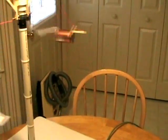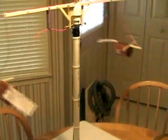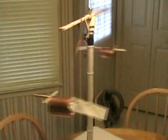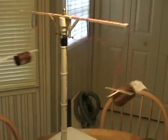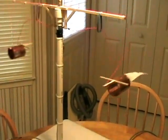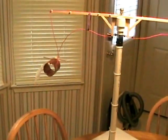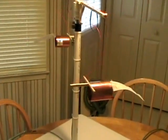This is the maximum output of the coil at this time. If I slide the dimmer switch, it will decrease the output. The rotors will slow down and may eventually even stop. But even when the thrust is too low to make rotation, you'll see the tissue paper continue to waver. This is almost the lowest setting of the coil — it will slow down and may even stop from lack of thrust. You can still hear it hissing and humming. Even though the rotors have almost stopped, the tissue paper is still streaming behind it because of the ion wind.